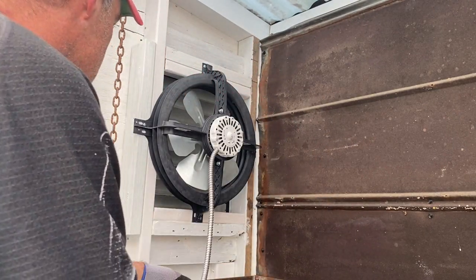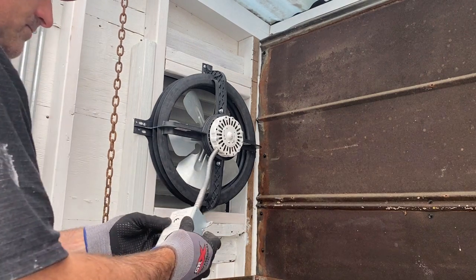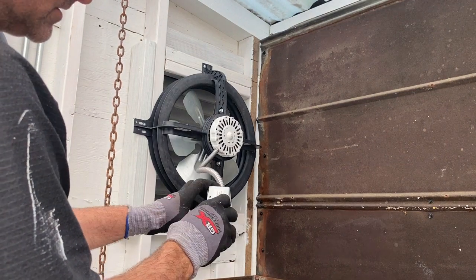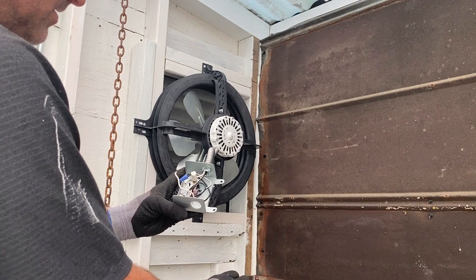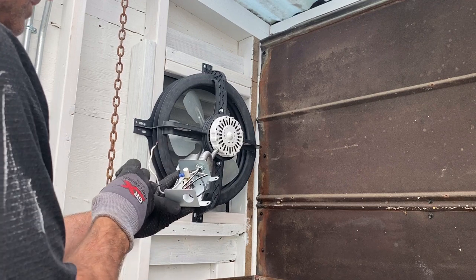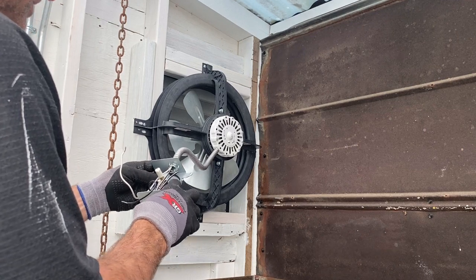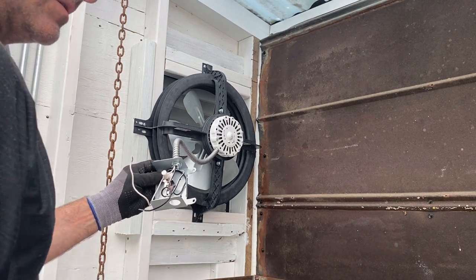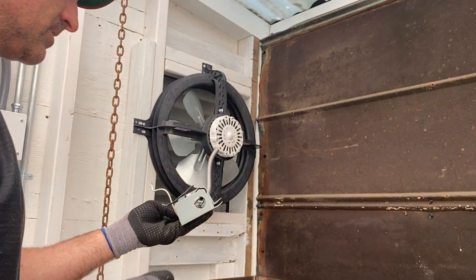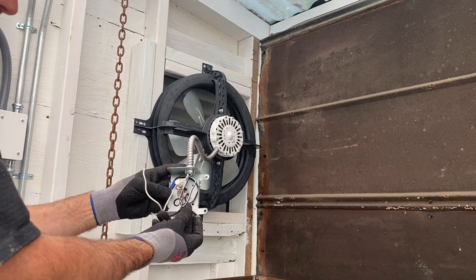That part's done. I'm going to mount this thermostat just off to the side over here. This J-Box opens up from the side — it has these tabs with four holes; you just spread it out and open it up. You'll see there's a neutral, a hot, and there should be a ground screw. Depending on how you're wiring it, if you're in the attic, you'll use either a Romex grommet or a squeeze connector and bring your Romex right into this hole.